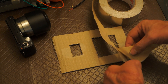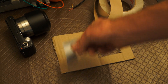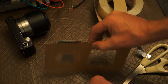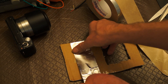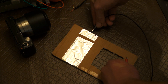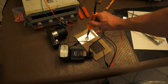First I'm going to make a really simple trigger out of a couple of sheets of aluminium foil and a piece of cardboard — this is actually aluminium tape, which is a bit easier to use. I'll tape that over the hole leaving a bit hanging out the end, repeat that on both sides, then clip two wires onto each side. When the bullet passes through the center it'll make a conductive path connecting both sheets together and firing the flash.